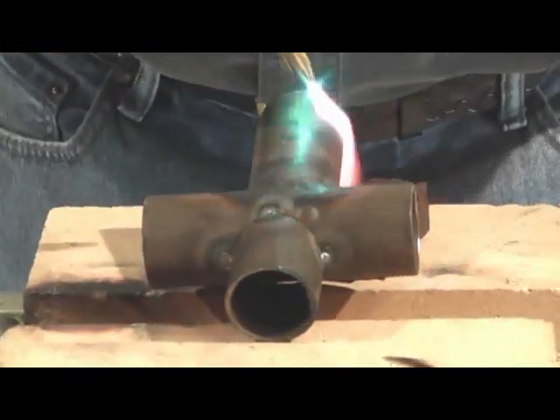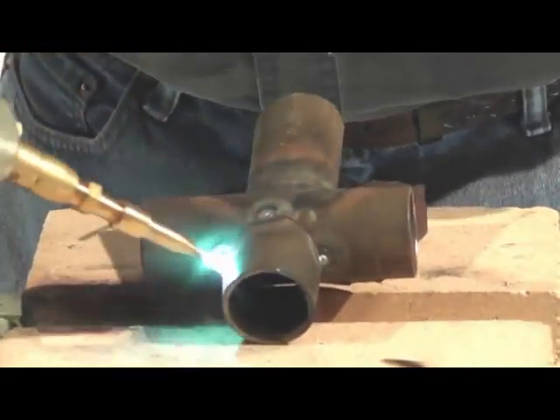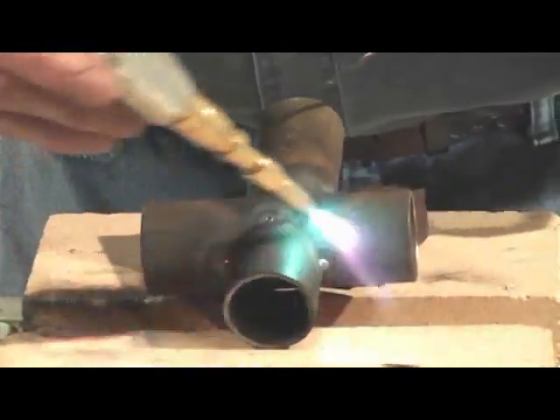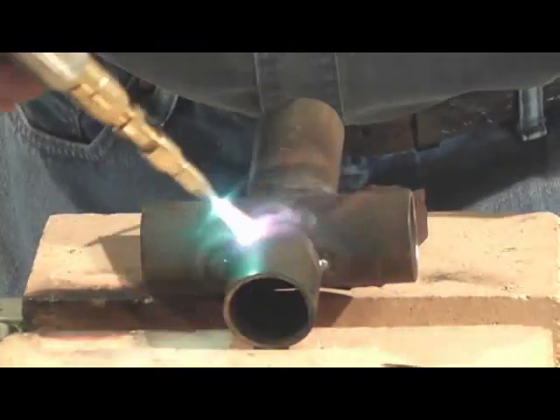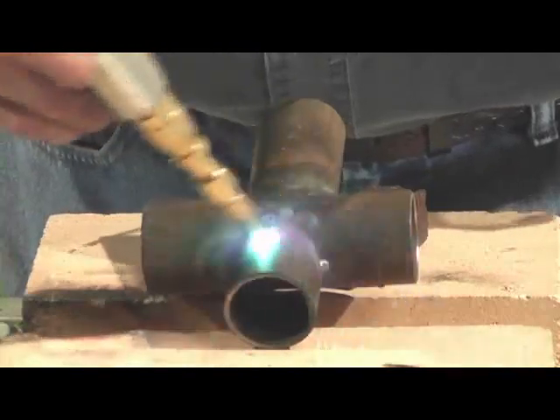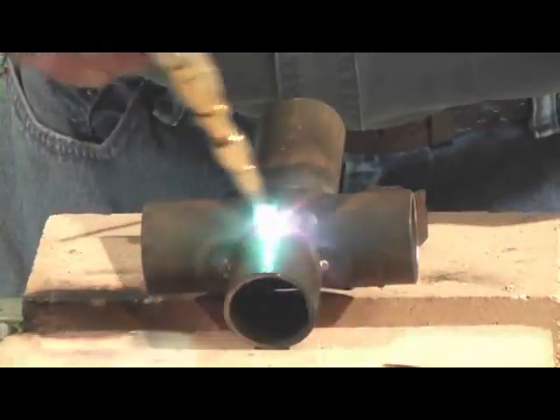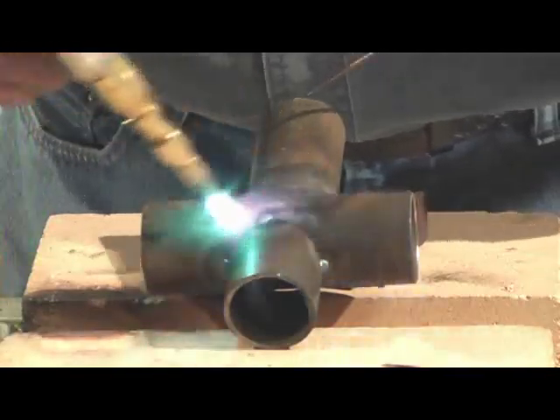Especially if you're used to getting cluster joints. Sometimes you're doing a rosette weld — tubing inside of another one. So always preheat at least 300 degrees on that chromoly tube. You want to preheat, post-heat, and stress relieve it.